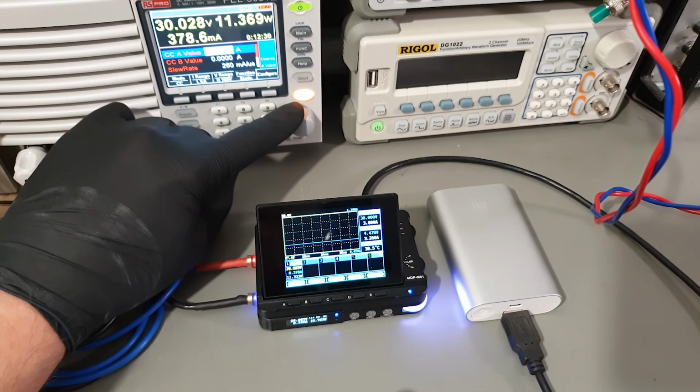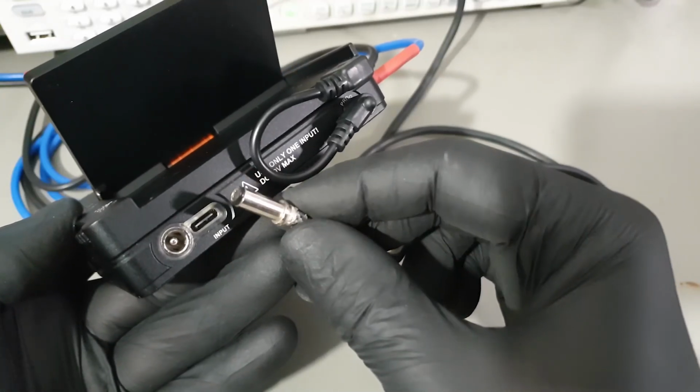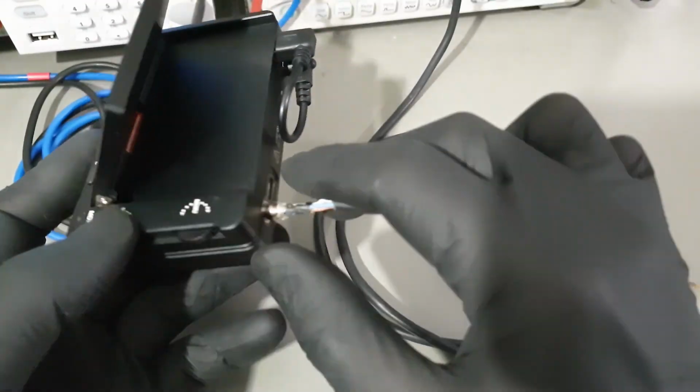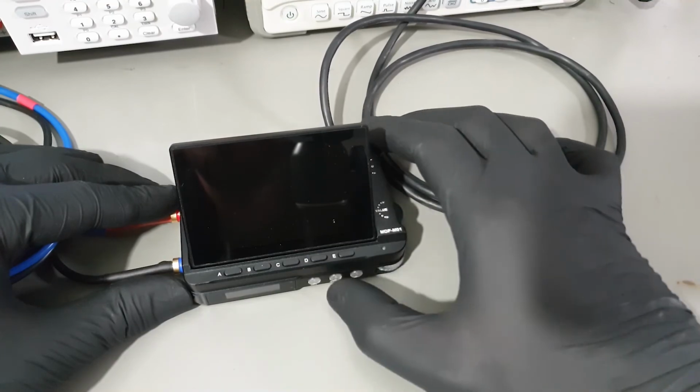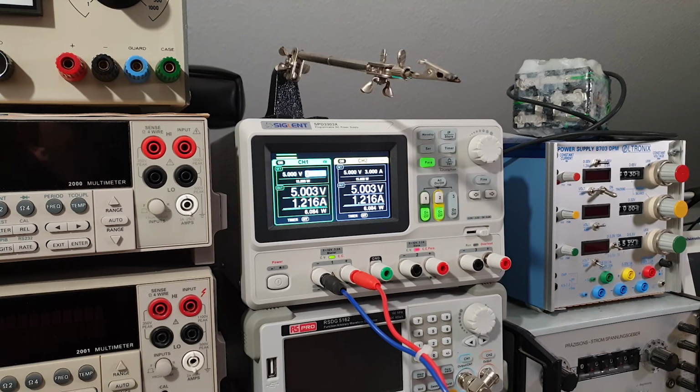Luckily, it has a TS100 compatible DC barrel jack as well. For ripple measurements, I'm going to feed power from a trustworthy source into there, because my USB power banks are passing out way too quickly. This way we can play around with the highest possible power and look at the effects of various in- and output configurations on noise and transient response time.